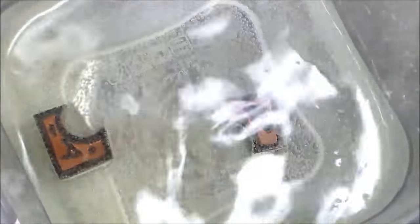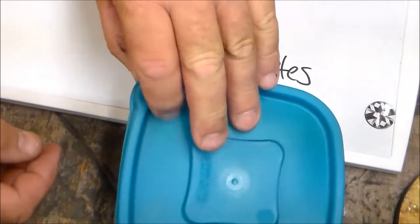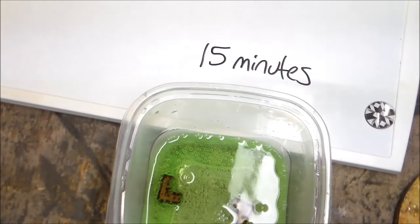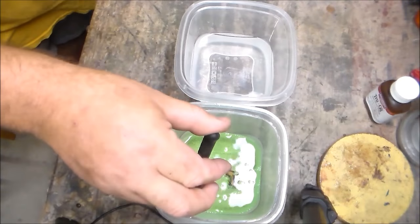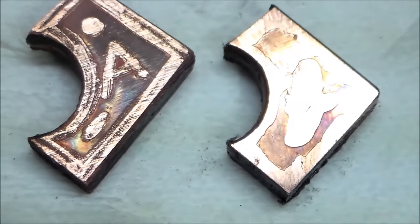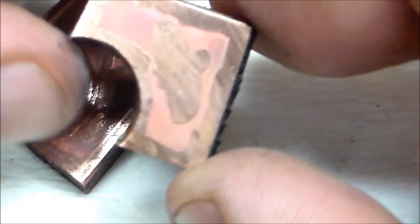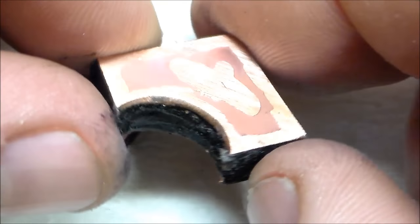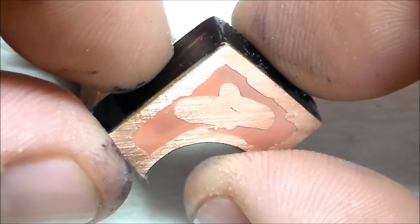Within just a few seconds you'll start seeing a green color coming off that copper. Having no experience with this mix, I just randomly chose 15 minutes for my first test. I cleaned off the tops with some acetone and was pretty surprised at how well it etched in just 15 minutes. There's a pretty noticeable depth there — you can catch your fingernail on it, you can see it, the light catches it.